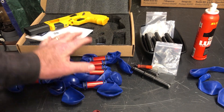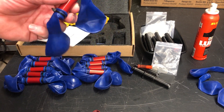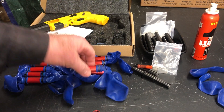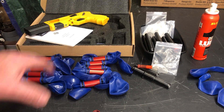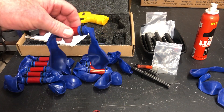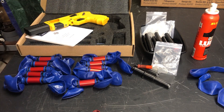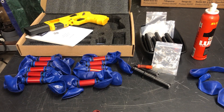This is the first half. These 10 have all been done up the same way, all charged to 4,500 psi. They're all going to go into a box and sit there. Next Saturday I'm going to look and see if any of these have air on one end or the other, or if any have burst — in which case a lot of air came out. So instead of just saying maybe there's a problem, maybe there's not, this is a step in the right direction: we'll at least know on these 10 if anything leaked and at which end.